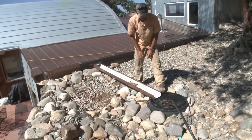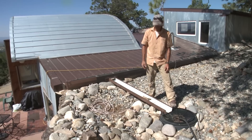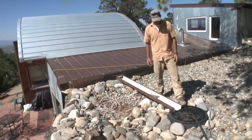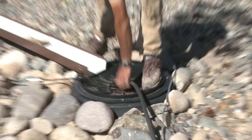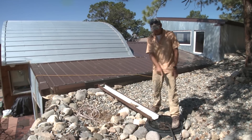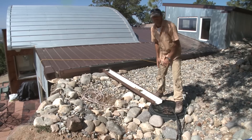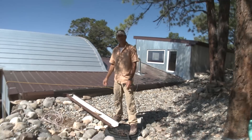This system is just for landscaping needs. The homeowner wanted to plant some trees and Russian sage on this property, so we simply attached a submersible pump inside the tank. For now it's just run to a cord on a timer on an exterior outlet, and the hose from the submersible pump is attached down in the ground to some drip irrigation lines that the homeowner installed to his trees.